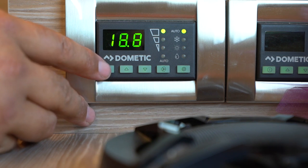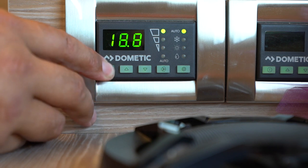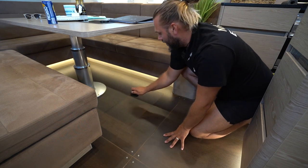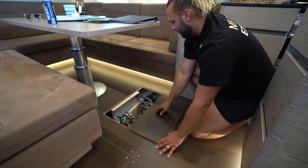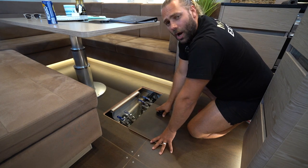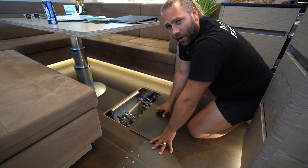To turn the air conditioning unit off, hold down the power button. It's very important not to start all air conditioning units at once — this is a huge draw of power and you could trip the fuse on the shore power or generator. Start two panels and then wait 10 minutes before starting the next two panels. The air conditioning service valves are located underneath the saloon table under this panel. Take the suction cup and lift the panel off. If you see HP displayed on the panel, that means high pressure and you need to bleed the air out of the valves.